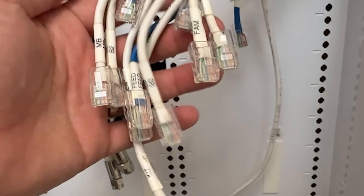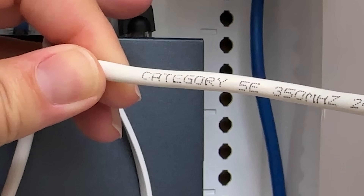All of the hardware that I have for that video is on its way, but I might have made a huge mistake. My entire house is wired with ethernet cable, but it is Cat5e, and Cat5e maxes out at a rating of one gigabit speeds. From what I read, you can go over the one gigabit speeds, but that is going to depend on a lot of things — the quality of the cable, the length of the cable. So I might be in trouble when it comes to upgrading my home network. In today's video, I want to test that out. We are going to set up a home lab to run speed tests on my cabling in my walls to see if I can truly take advantage of a 2.5 gigabit home network.